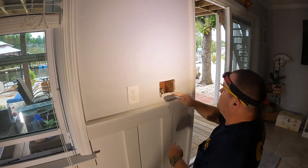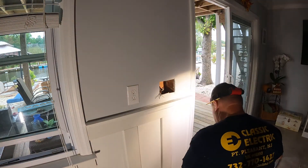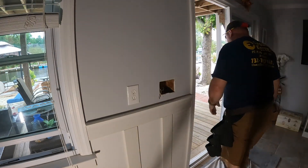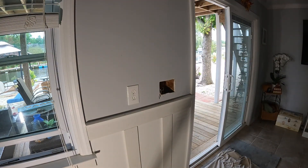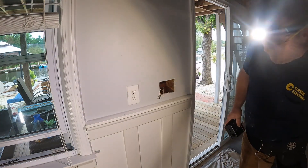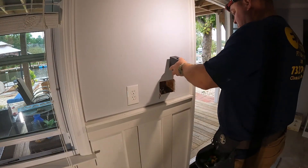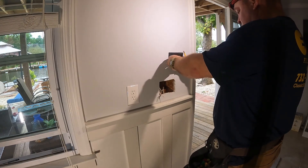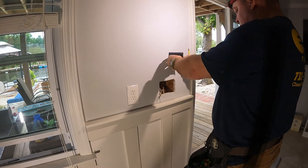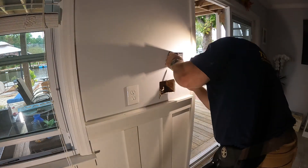There's going to be an outside junction box, and I'm going to run along the outside of the house with three quarter inch PVC, running three different circuits. Two of them are going to be 20 amp 120 volt circuits, and the third circuit will be a 20 amp 240 volt circuit for the baseboard heater. Before you put these boxes in, you want to leave the access holes open in order to snake your wires from the outside junction box to the line voltage thermostat and for the two switch legs.